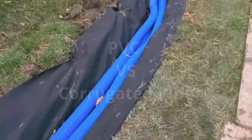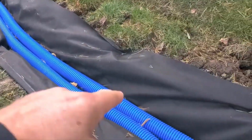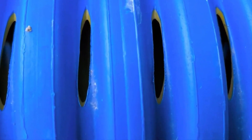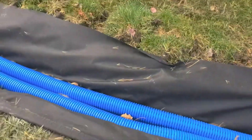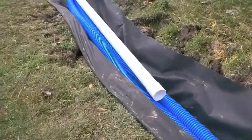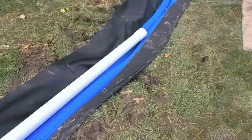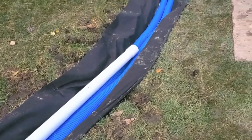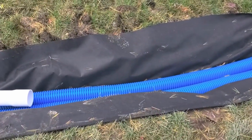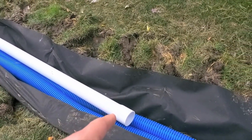Welcome to the French Drain Man channel. I'm Robert Sherwood, and I'm here to talk about PVC pipe and how it doesn't belong in yard drains. We have four of the high-octane pipe — it's got monster inlets, 360 degrees all the way around the pipe. Then we have this piece of PVC schedule 40. It's got two holes on the bottom. Now we got four pipes in here creating more void, moving more water than stone itself. This is why PVC sucks.